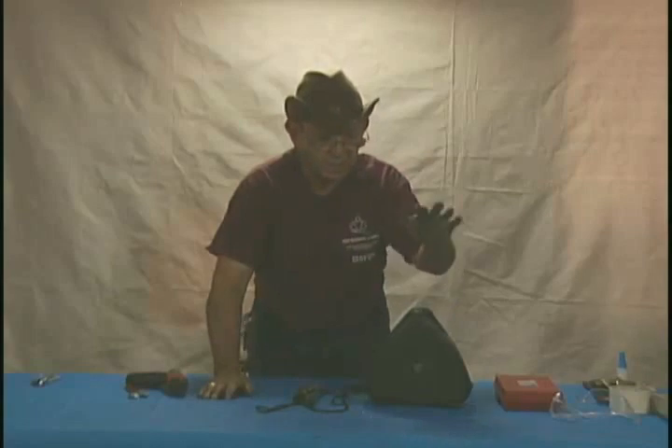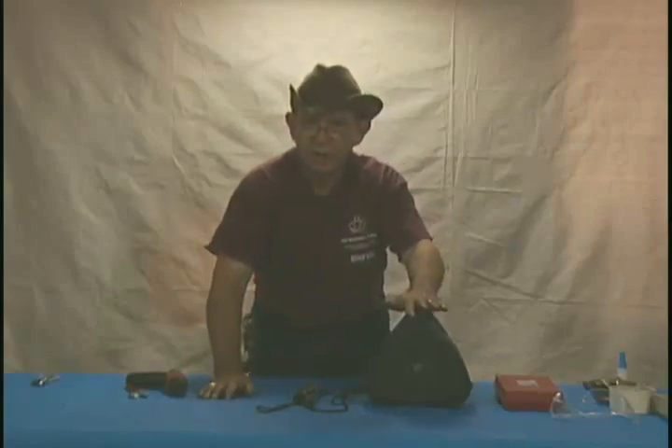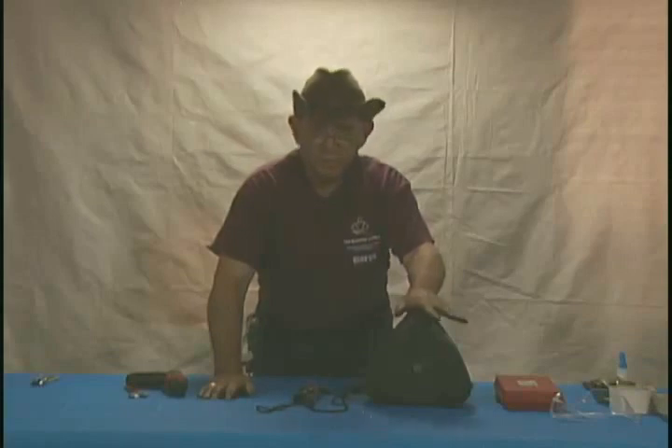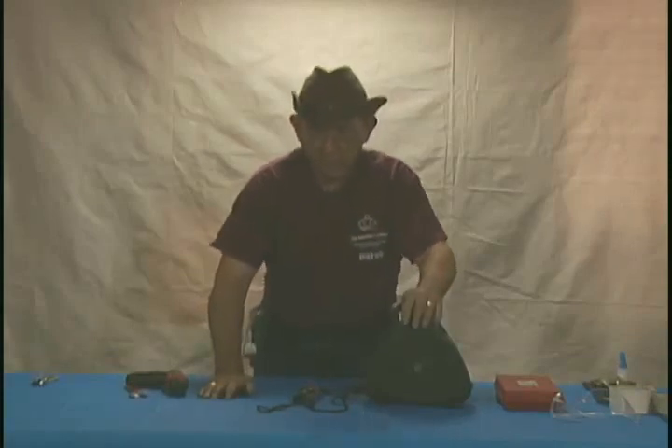By that time, you're probably looking at replacing the cable. As I said earlier, replacing the cable on this one is easy — all you've got to do is undo the strain relief knot, remove the cable, feed the new cable through, connect up your wires, wrap it around the spool, and put it back in. Very easy to do.